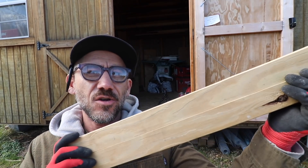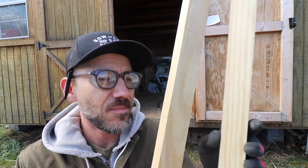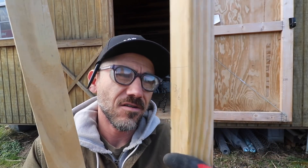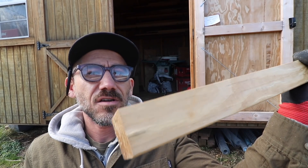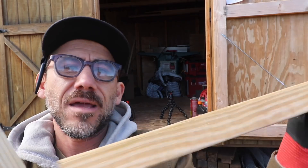Now that is a beefy 2x2. If you were to buy 2x2s already pre-cut at the hardware store, they're a lot smaller than this. These ones actually measure out to about 1 and 3/4 by 1 and 1/2 inches. For a chicken coop or chicken tractor, you're not going to need anything bigger than this, really. This is going to hold in a chicken and keep out a predator — these are really beefy boards. Also for a rabbit hutch or tractor. And these will make strong walls if you're framing out a stationary coop — you don't need a full 2x4 to make that happen.